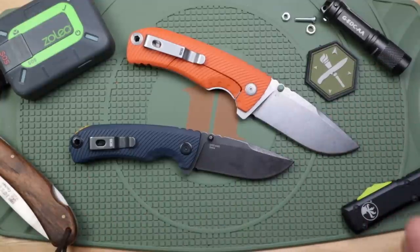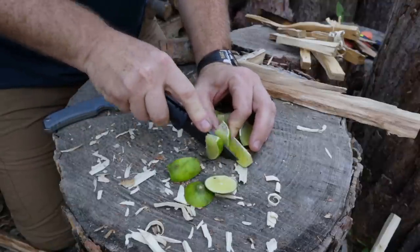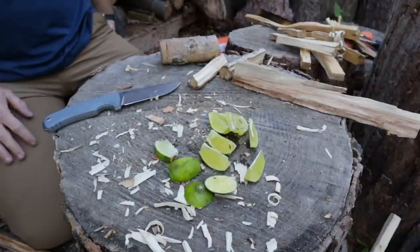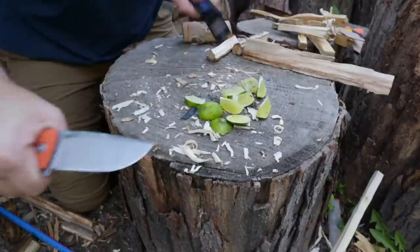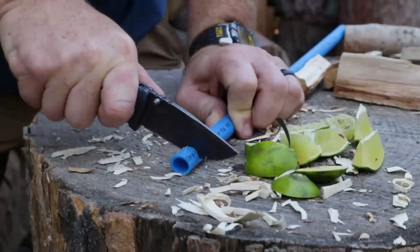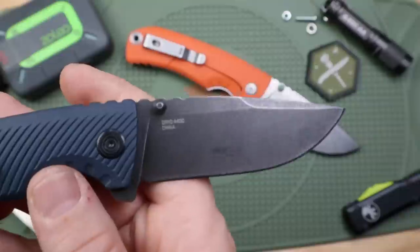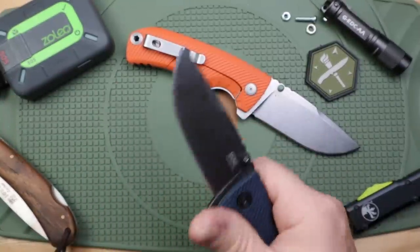The steel is Rockwell 58 to 60, which is a good Rockwell for 440C. 440C is very stainless and rust-resistant, which is great if you need that. Because of that 58-60 rating and the cryo treatment, it's going to have better edge retention than your 8CR and AUS-8. It will take a little bit longer to get a good edge on it, but the relief edges on this entire series are excellent — this one actually bit me twice, it is razor sharp. The entire series was really ground in well.